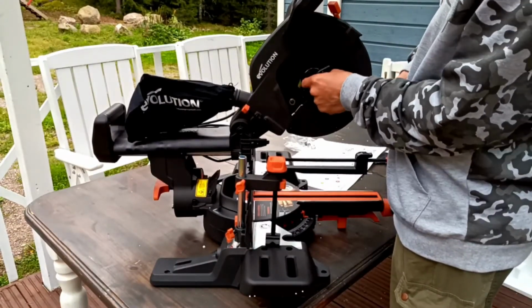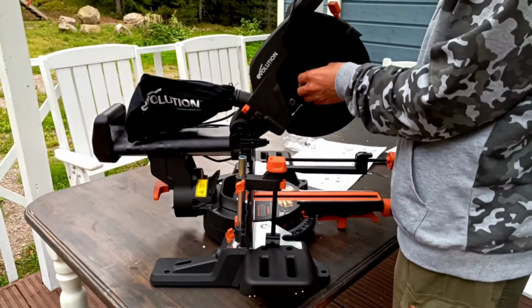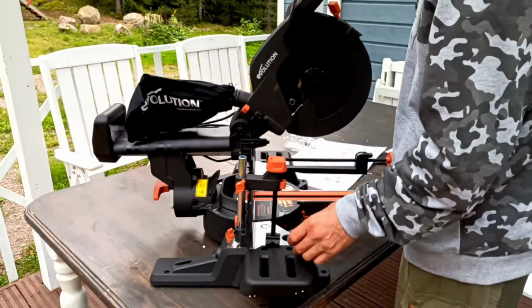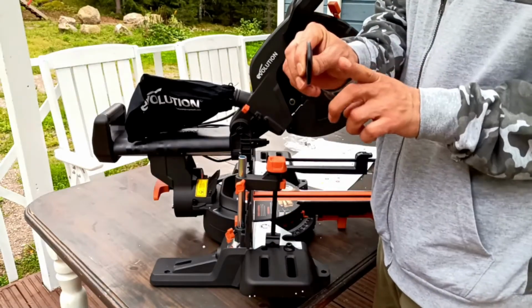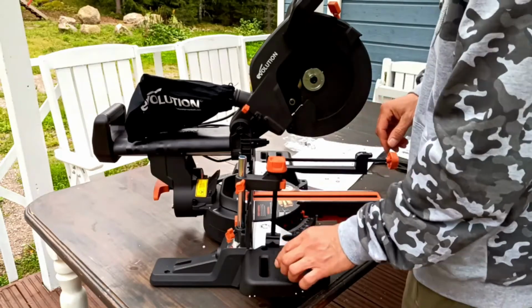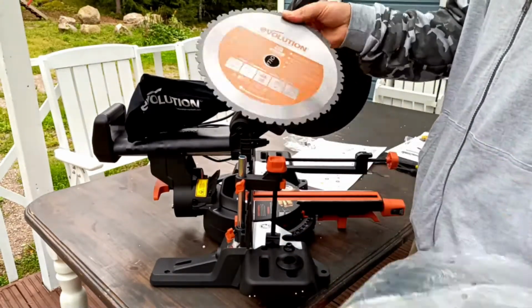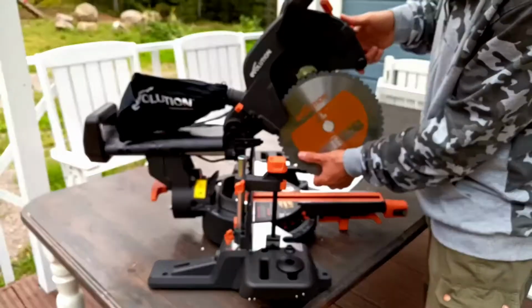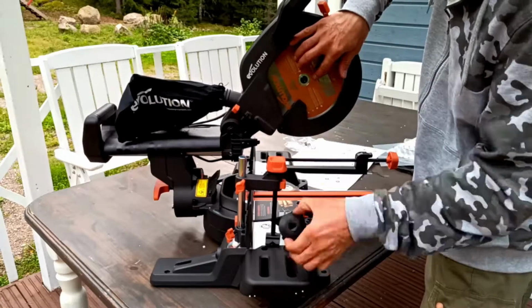The screw that holds the blade is opened or released clockwise, unlike normal screws, and the slightly curved mount of the washer should be directed outside. This blade is for steel, plastic and wood.